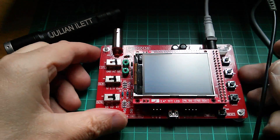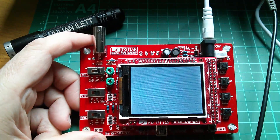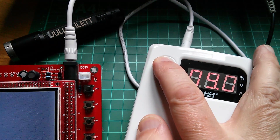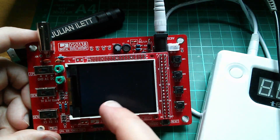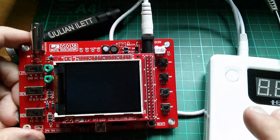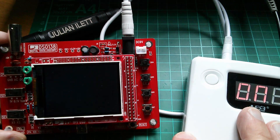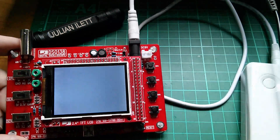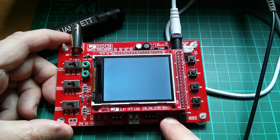The question I'm asking myself is: did I kill this, or did it just fail of its own volition? Did I kill it with this power bank? Because if you switch it off, this display is very slightly still lit up — the bank puts out the 3.7 volts of the batteries themselves even without the boost circuit running. You then switch it on, it flashes three times, and power comes on. But notice that double flash on the green LED. When it goes from 3.7 volts to 9 volts, the microcontroller appears to boot normally.